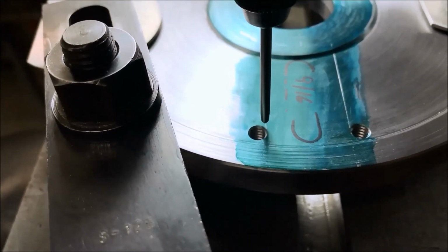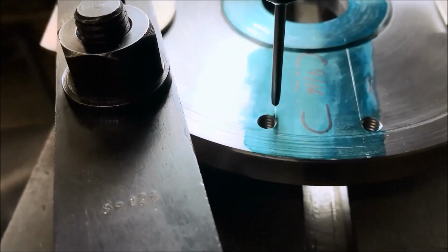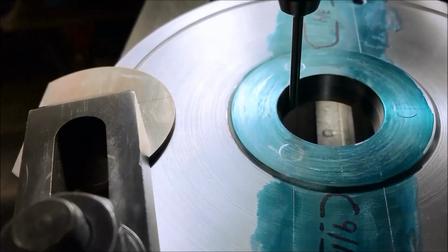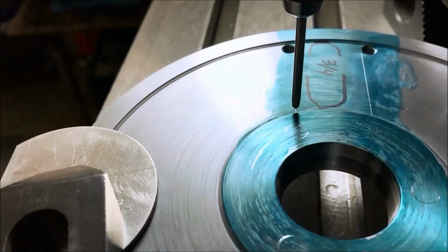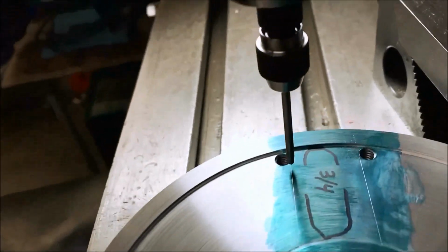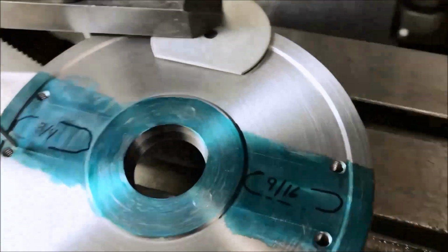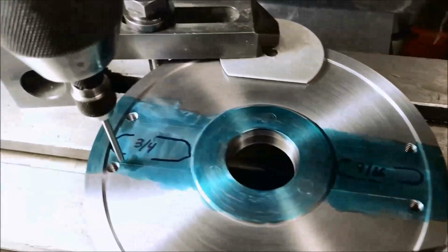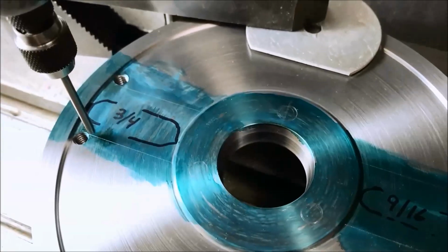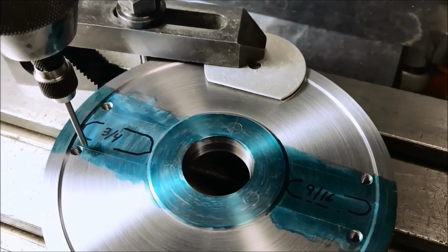And there's a little bit of deviation on these bolt holes. They're not perfect and symmetrical, as we mentioned before. All right, we're going to call that good. So that's going to line us up for doing our two slots. Sorry about the glare here. There we go. But before we do those, we're going to do our hole pattern. So next thing we got to do is indicate the center. So we get on center.